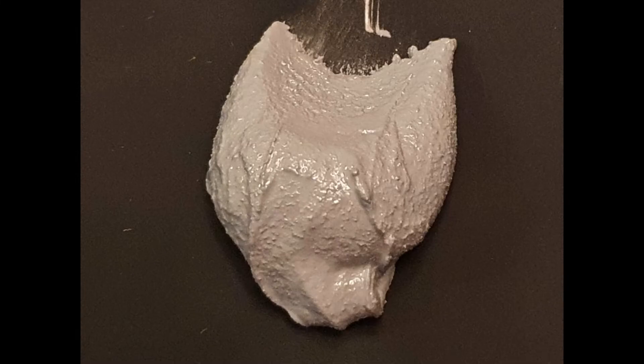Lastly we've got the TG NSP80. This is also made by T-Global although it's rated lower than the TGPP10. This has a bit of a different consistency — I would say it has a higher content of an adhesive. These typically do use a bit of adhesive to bond the silicone resin and the filler, whether it's a ceramic or an oxide or a diamond powder, or whatever they want to put in there that doesn't conduct electricity.